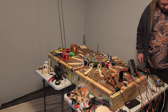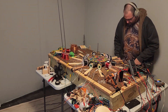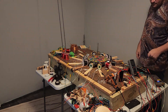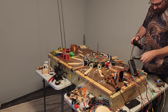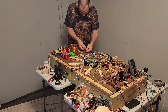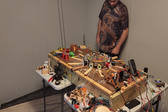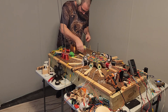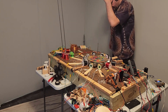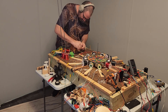Hey, what's up everybody, this is Papa Bale. We're doing a time-lapse video of me getting the coils basically facing the right direction so that the voltage is max from one side to the next. I've got three cores in this setup. I don't think I'm going to be able to run cores — I was just doing it for fun. I got lots of voltage, but the magnetic cores really slow everything down and stall it out. Without power it will eventually stall out. With the cores in, it stops a lot faster, and I don't believe the energy in the capacitor is utilized appropriately.